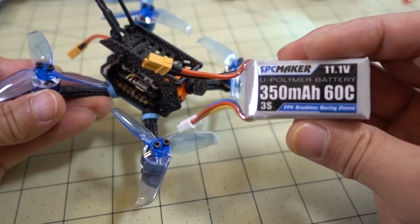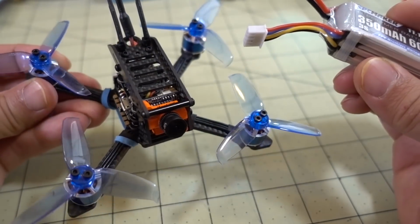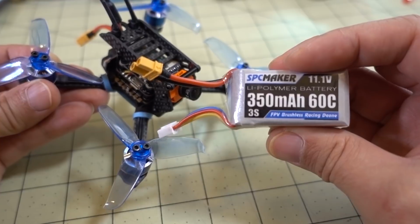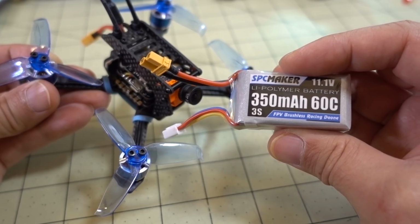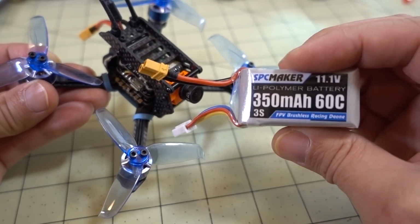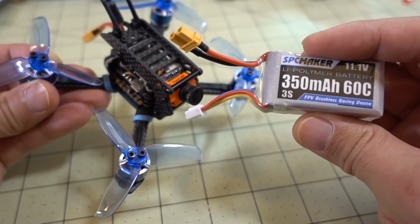I would recommend SPC Maker bumping this up to at least a 450 or 500 as a minimum. This can definitely carry the weight. It's got plenty of power for that. So the 350 is just too small of a battery. I would recommend upping the battery so you can get at least 3 to 3.5 minutes of flight time on, say, a 450 or 500. That would be my recommendation. And if you have other batteries that are bigger, those would definitely work. And I'll put some alternative batteries in the description if you guys want to try those out.